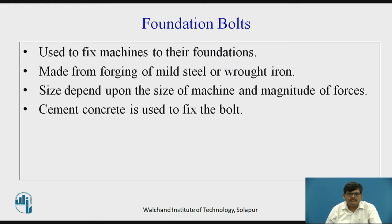These bolts are fixed to the machine with a nut and bolt arrangement and fixed to the ground or concrete foundation with cement concrete. A pit is dug into the ground, concrete is filled, and the foundation bolt is suspended into that concrete. Once it sets, the bolt is firmly fixed, and the machine is mounted using the nut and bolt arrangement. Foundation bolts play a very important role as they transfer vibrations and forces generated on the machines to the ground, giving better functioning.